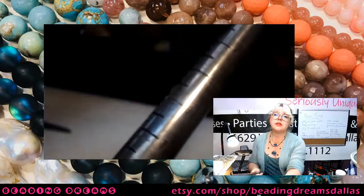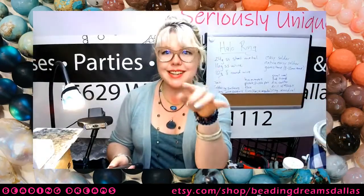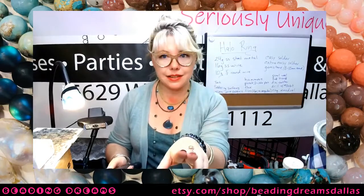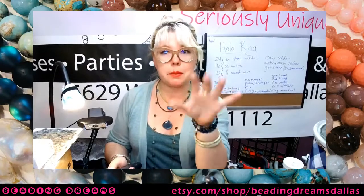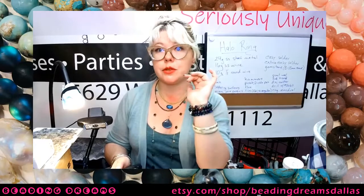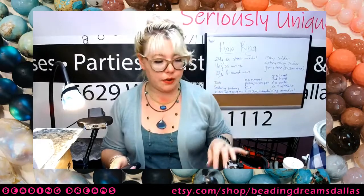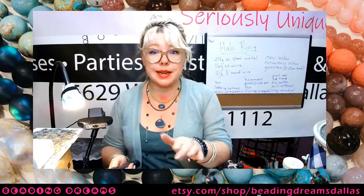you could use washers from the hardware store, Ace, if they're copper or brass, but not if they're nickel, because you're not going to be able to get the solder to work. But if you can find pure copper or pure brass washers, you absolutely 100% could, without a doubt. Speaking of washers, let's put that one there so that I don't lose it.